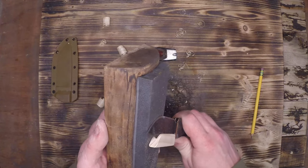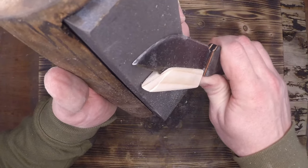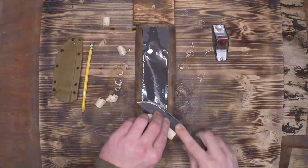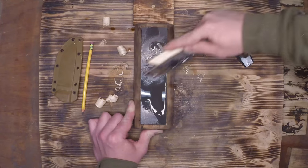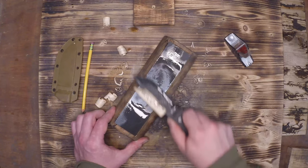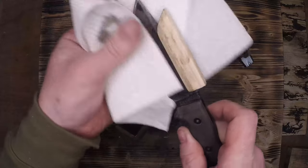At first glance this seems like it makes a really good guide to maintain the bevel across the entirety of the blade. My concern is that the wood would wear down over time as I work on the edge, so I'm going to go gently on the guide and grind with more pressure on the edge of the blade. To see what works best, I'm going to try several different sharpening techniques — starting with a simple push-pull method I use with hand planes and chisels, where you push hard forward and drag back lightly so you don't build up a burr. After trying my circular, push-pull, and swiping methods, my muscle memory kicks in and I just sharpen as I would any other knife. The only thing I have to stay cognizant of is keeping a little pressure on that piece of wood so I don't snap into my own rhythm and negate the guide entirely.